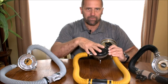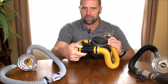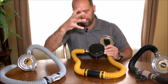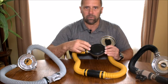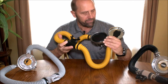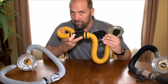When I inhale, this will collapse and stay there because in this mouthpiece there are a couple of one-way valves that keep water from flowing in. If it were introduced to the system — if I spit the regulator out, for example — it won't travel up into the regulator. When I exhale, you'll see this activate. This will not pop back up because of those one-way valves. So air is designed to travel this way through the loop and that's all it's going to do. I inhaled and collapsed the main diaphragm; when I exhale you'll see the duckbill valve flap. The main diaphragm didn't move because of the one-way valves in the mouthpiece.